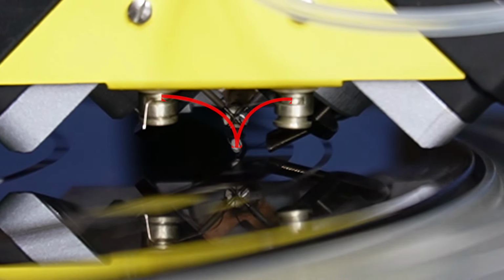Those are heater wires that keep the stylus tip warm. If you try to cut with a cold stylus, you'll hear a lot more surface noise, but also if you cut with too much heat, you can start melting the lacquer material and pushing the walls, kind of like a snowplow. We sometimes call those horns, and they can cause their own issues in plating and pressing.